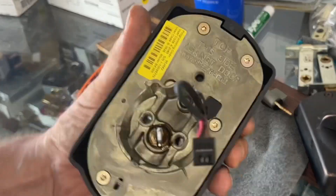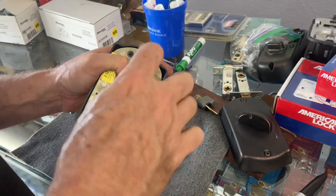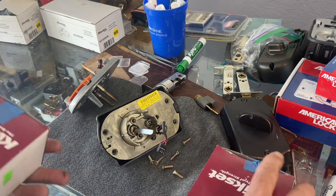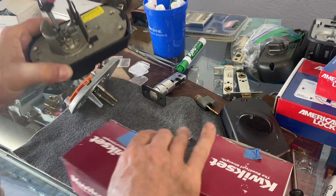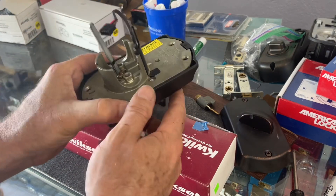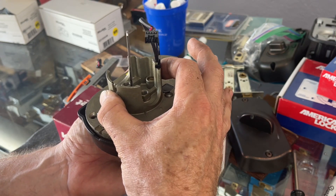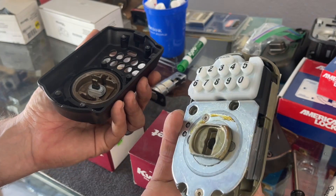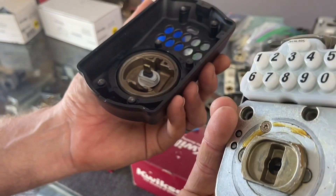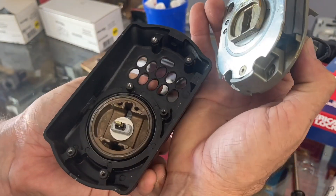Got the screws out. Whenever I take these apart I'll put it between two equal things — I'll show you why. We're just going to use Kwikset boxes here. When you get those screws out, you want to carefully lift this straight up. Don't rotate the dial or anything. You can rotate the dial if you really want to when re-keying, but I would suggest you don't. So lift this straight off and set this aside, leaving it in the same position.